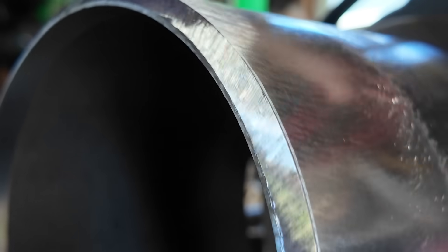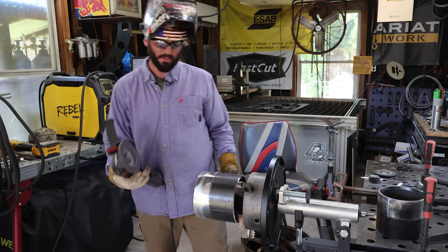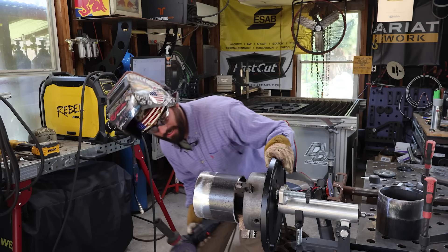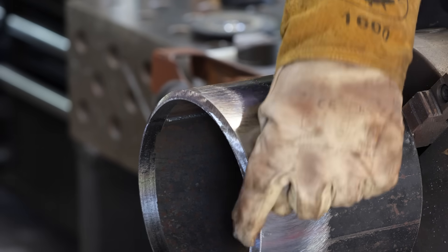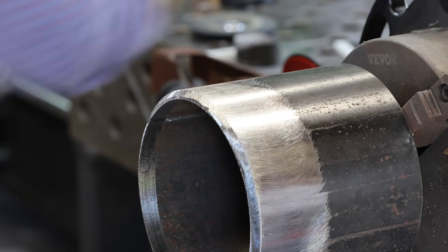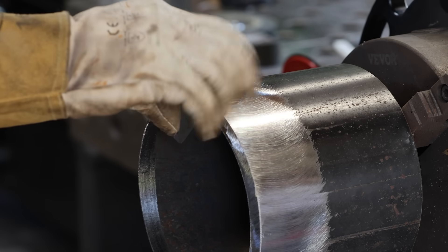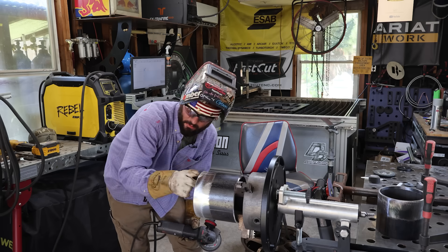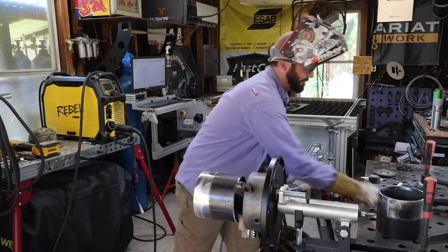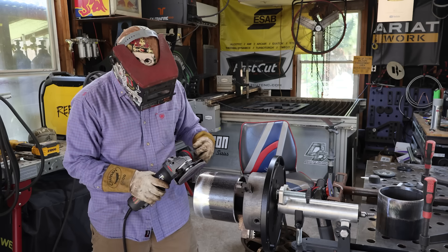I'm having to attack more of the root face than the back line because there's more of it showing — just keep grinding until the line gets thinner and pushes back towards the back line. I'm going to stop here with the quarter-inch grinding disc and swap over to a five-inch flap wheel, about 40 grit, which will still remove a lot of material quickly but really start smoothing things out. This is where I focus on getting that 35-degree bevel and eliminating the remaining root face.